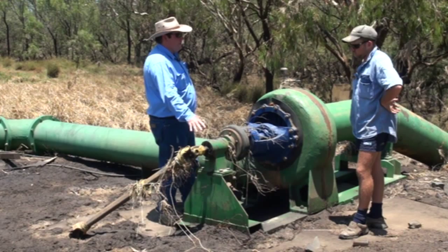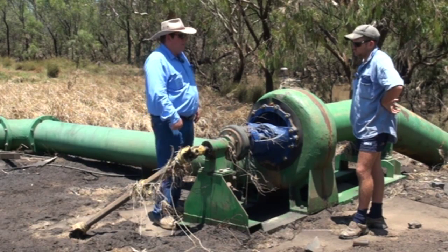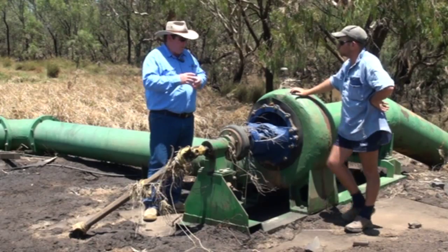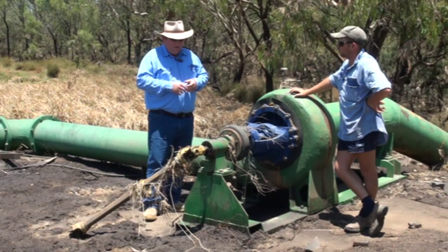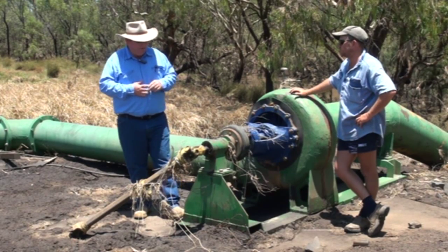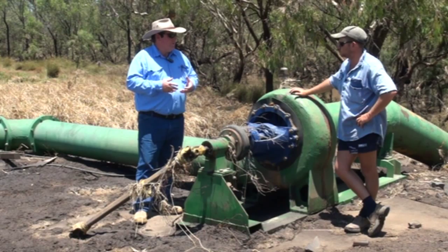You'd grease all this — that's a good idea. You'd probably give it a little more grease just to see whether any water droplets come out of the bearings, because if there's any water in there, when you get the pump going, the temperature rises fairly quickly and that's what does the damage to the bearings. It's a good idea to possibly use high-temperature grease instead of general-purpose grease — it's a little bit higher density, so it's going to help displace those water droplets.